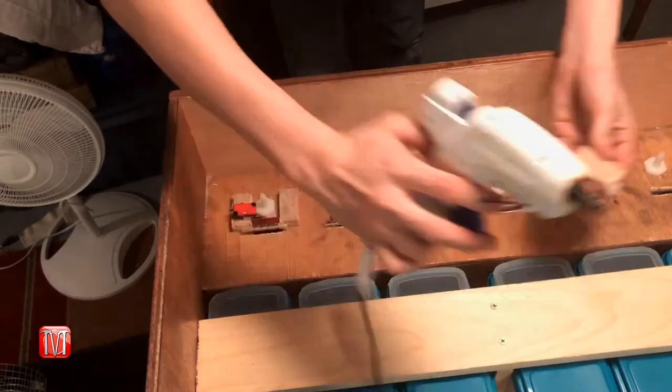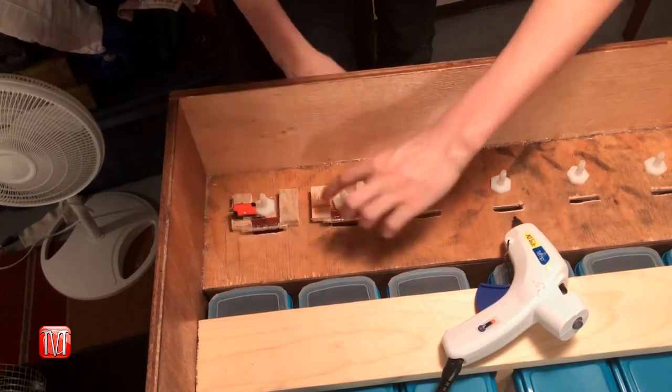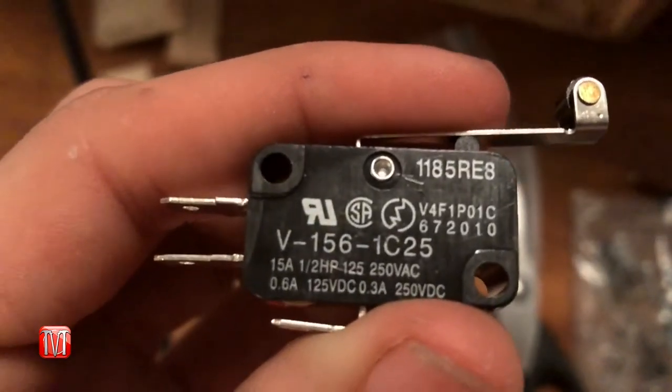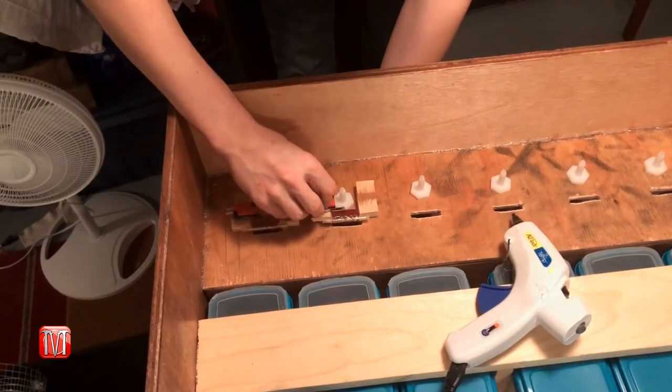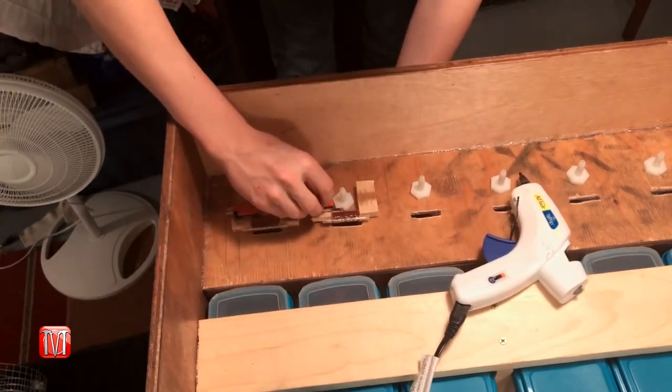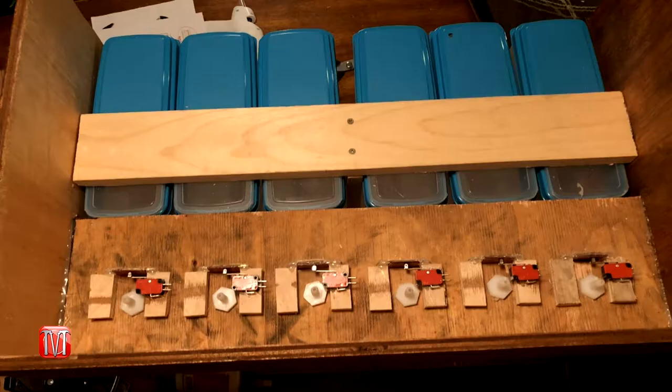Adjust each rectangle along both sides of the slit and place the acrylic into its slot, then hot glue both rectangles into position once properly aligned. Once aligned, grab your momentary switches and position each switch in front of the acrylic piece so that when pressing on the bottom half of the acrylic, the top should just be able to activate the switch.